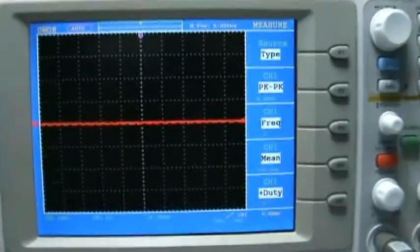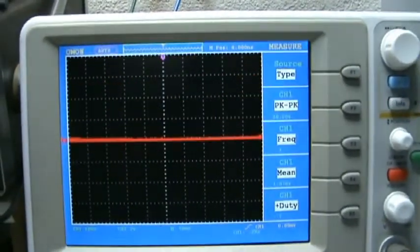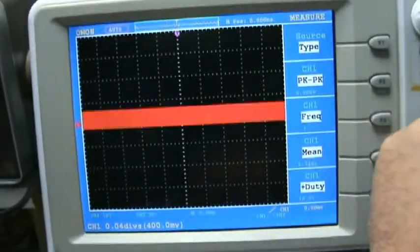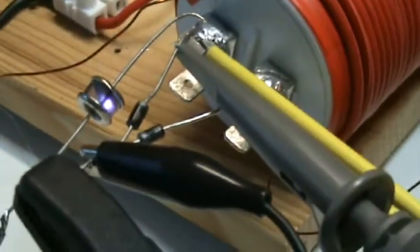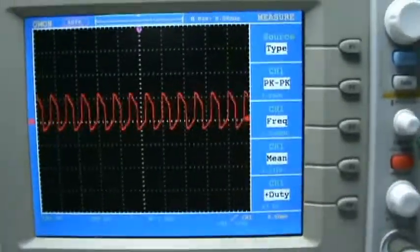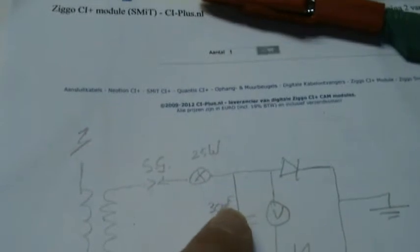Well, we are at 100 volt per division, and I will now attach the catcher. You can see the climb, now it fired, and now it stays like this. I can crank up the scope now, and while we are still having this plasma inside and we have no real voltage over the cap, we have this kind of signal. It's a 7 volt peak to peak 1.3 megahertz signal, which is measured at the plus terminal of the capacitor.